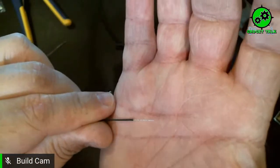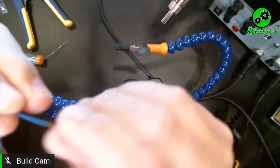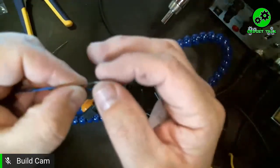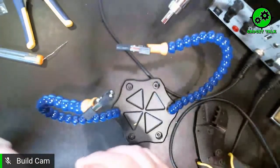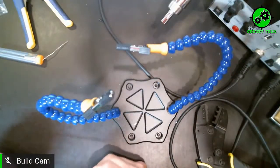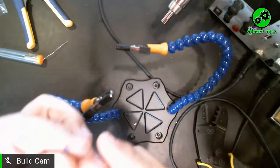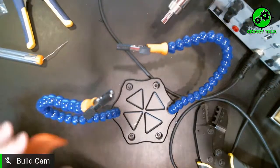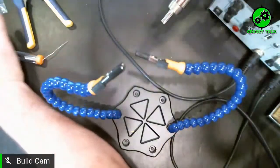So this is the tinned wire for the LED that we use, versus here, let's see if we can do that, a non-tinned wire. Right. So this will be a lot easier to put inside some wire nuts or to solder to a component or anything. And typically what I would do with these is solder them to a PCB board or something, which we can go over. You can solder them together and then put a heat shrink tube on it. Whatever you want. We can go over that a little bit here. Okay. In a bit. So that's how I tin the tips of them.